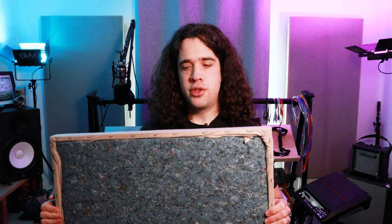When deciding on the type of material to use as the insulation inside of your sound panel, there are a few considerations, but the two I focused on most were budget and safety. The two most popular materials are mineral wool and fiberglass. My gripe with these materials is that they have fibers that are harmful if they shed off and are inhaled — they can be bad for your respiratory system, and they're also just a skin irritant, so you have to take some extra safety precautions when handling them. You can completely wrap these materials when creating your panels by putting fabric on the back to contain any fibers that might break off. However, this just adds to the cost. I will acknowledge that fiberglass and mineral wool are very applauded for their extreme fire resistance.